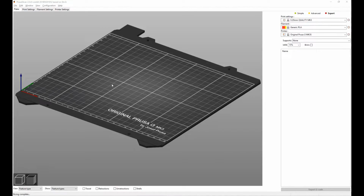But the cool thing with PrusaSlicer 2 and P2PP is that it's all integrated in one package. So you click slice and out comes an mcf.gcode file that you can send directly to your Canvas hub and then print in multicolor with the Palette. It requires you to use connected mode. It doesn't work with accessory mode.